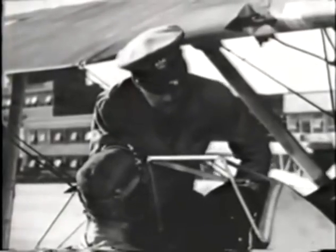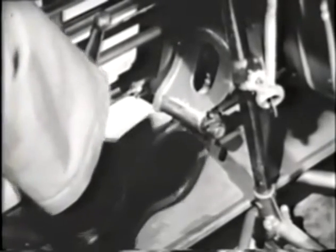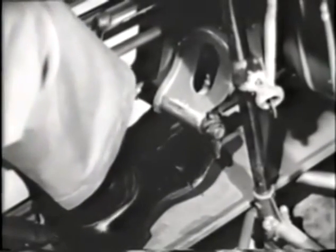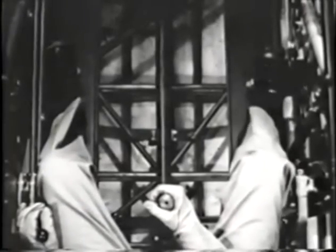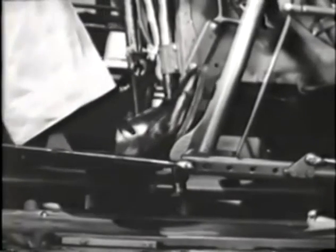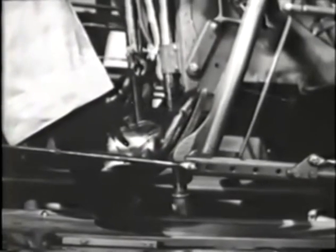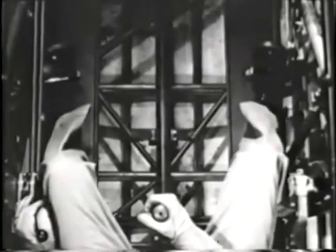Now you're ready to adjust your rudder pedals. Push that little metal lever on each pedal to the inside. Adjust pedals so you have full throw and can comfortably apply brake without stretching, and so you can rest your heels comfortably on the deck with the balls of your feet placed lightly against the pedals, with your knees relaxed and the weight of your legs on your heels. Then make sure each lever is back in locked position.